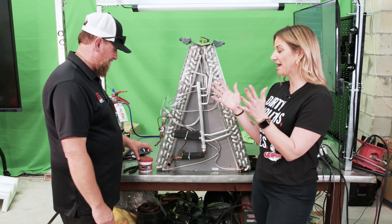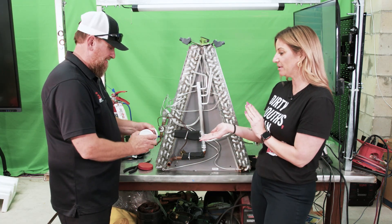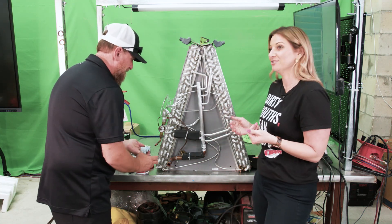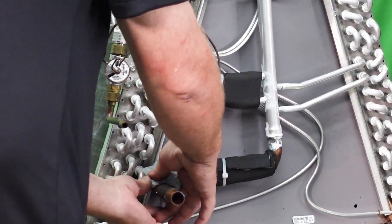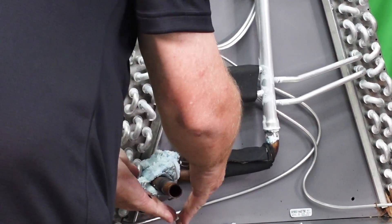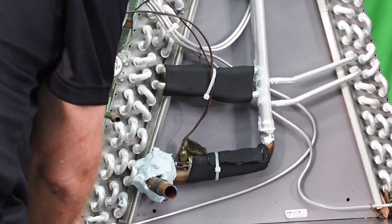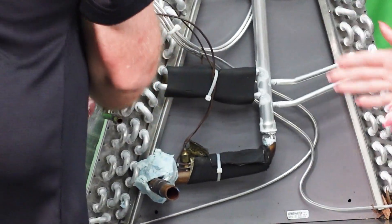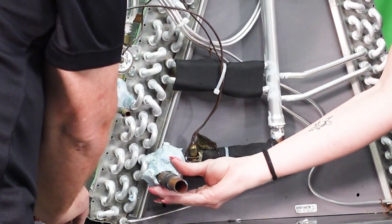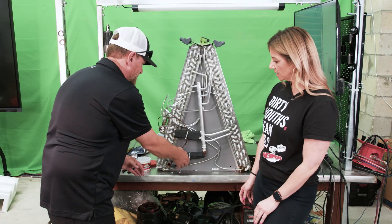We're going to do extra protection. We'll start off with our wet rag heat blocking putty. It feels like sand — I like it. I'm going to call it sandy. You're just going to clump it on there. Since it is reusable, there's not really too much. Make sure there's no holes and it's all pressed tightly against the pipe.